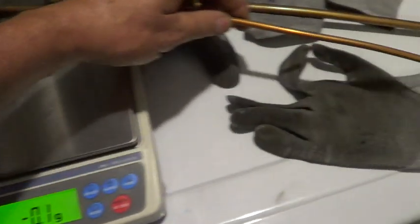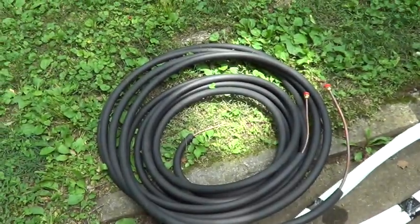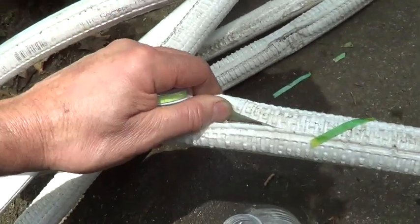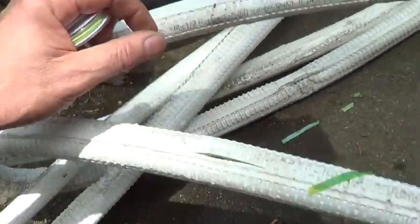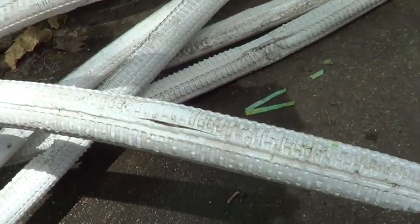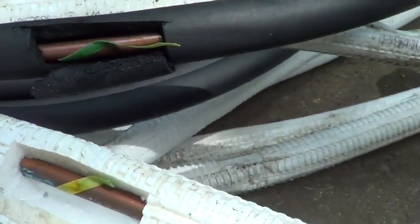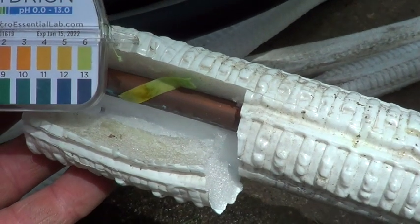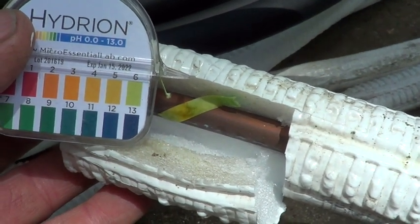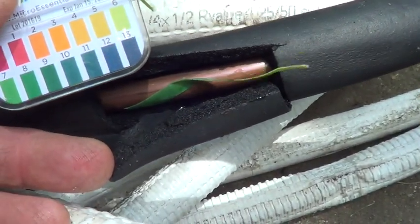So the quarter inch seems to be a little thinner. I have a pH tester — let's check the difference between the Mueller and the white line sets on the pH. I had to add a little bit of water to make sure the line set is wet. I did it on both of them. You can see quite yellow, quite green, and then we match up our yellow — it's probably a pH of five, versus a neutral pH of seven.